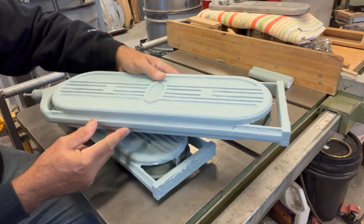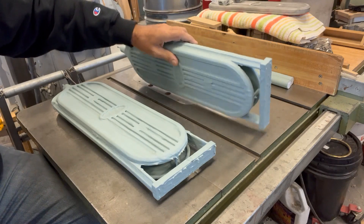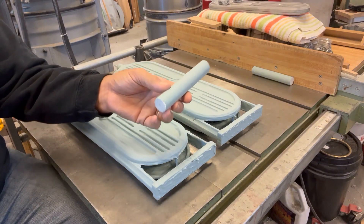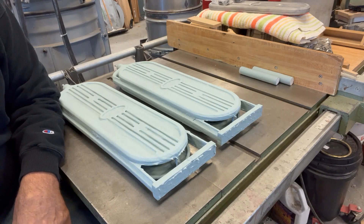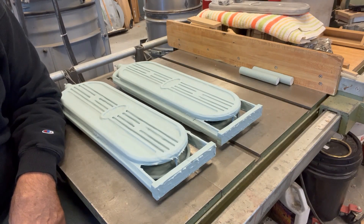The only other thing I need to do to these before I cast them is cut the little wooden block off here, and cut the little plug that I glued on for hanging off. Then when I actually put them in the flask and vibrate and pack them, I'll glue the sprue on as the last step right before I finish packing it. I'm not going to include in the video all the steps that I do to vibratory pack them in my flasks - if I make every video a step-by-step how-to of every process, the videos just get too long. But if you're interested in my molding rig and how I pack them, you can take a look at the other videos on my channel.